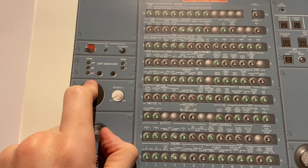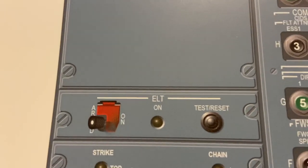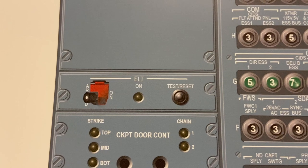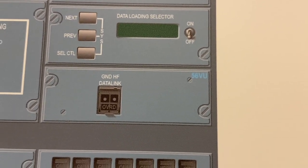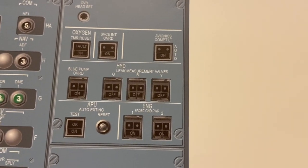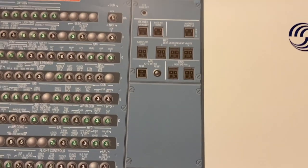This is the cockpit door system — three types of locks. It tells us if they're all working, and there are two channels to tell us if one has failed. And this is the ELT — emergency locator transmitter. We just leave that basically. Don't ever test it or switch those switches — it's for maintenance, but it's always in the arm position in case of emergency. Over here is HF data link override — all maintenance stuff. Another reading light and more maintenance push buttons we don't really use when flying on the line. And this is just a CVR headset — you can plug headphones in there and listen to the CVR.